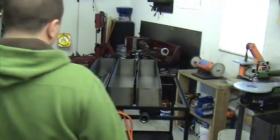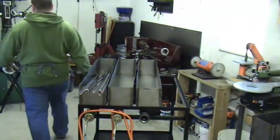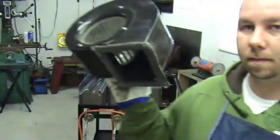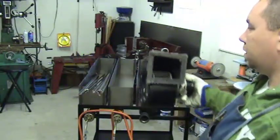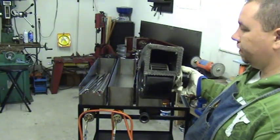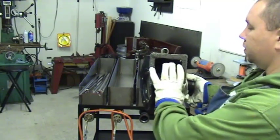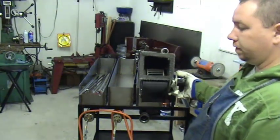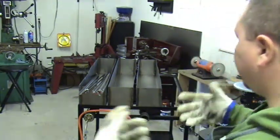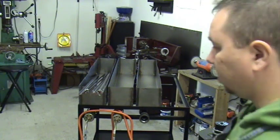It's not going to be a system that sucks the air out through my squirrel cage fan. The squirrel cage fan — high volume fan — is going to sit at one end and blow through. I'm going to make louvers so air is drawn in at a venturi effect, but the fumes will never actually interact with the fan itself. I'll start making the frame and turn the camera on once I have a couple pieces cut.